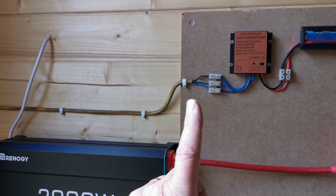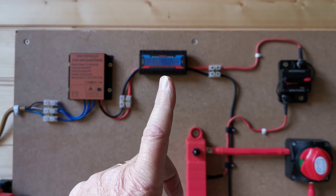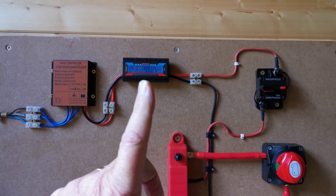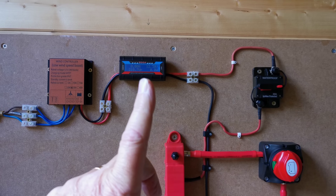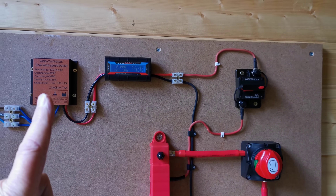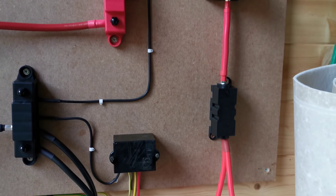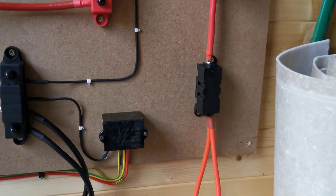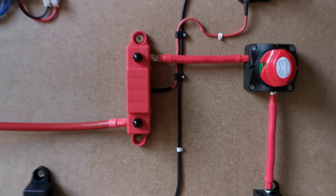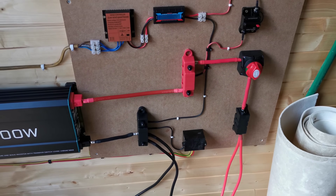So that's my system so far: three-phase AC in through a terminal block, 30 amp charge controller — when it's windy it will put out up to 30 amps — my meter telling me what's going on, top of the circuit protected by a 30 amp circuit breaker in case the charge controller goes mad, an emergency on/off so I can work on the system, and the circuitry also protected by a 200 amp mega fuse. It might be a little bit over-cautious compared to some circuits I've seen, but I thought a few guys out there might want to see my attempt at circuitry.